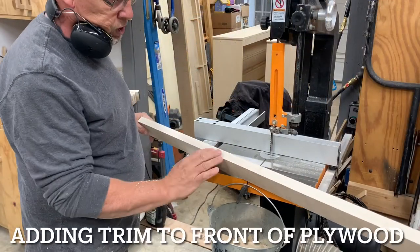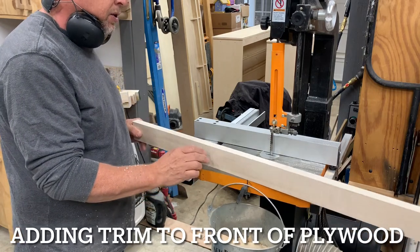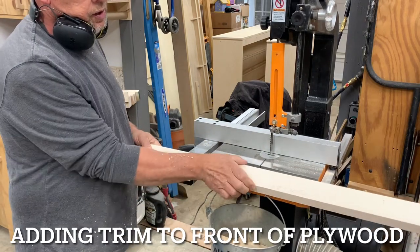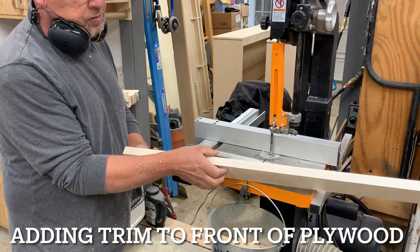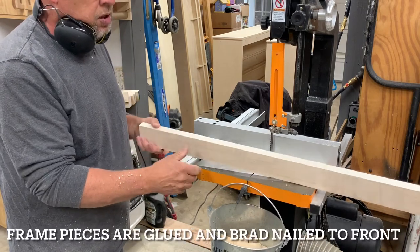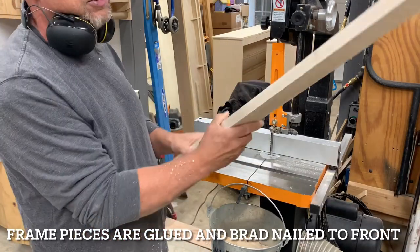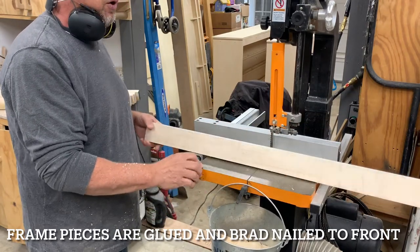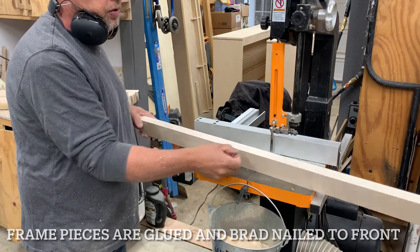For the frame of the front of the beds, we're going to take some soft maple. I've already cut it down to two-and-a-half inches wide. It's the normal thickness you buy — thirteen-sixteenths, I think. We're going to cut it in half. I don't want to put a full thickness here — it's just adding too much weight to the front and the mechanism might not work right. So we'll cut this in half, and then we'll probably need to plane it down to a quarter-inch.